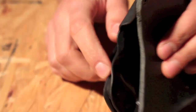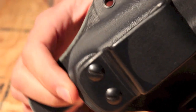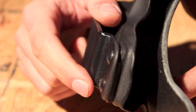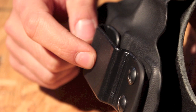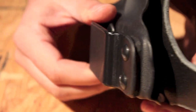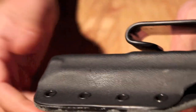Also, instead of using a gnarly little piece of Kydex as a spacer here — I can't tell what that is because I couldn't get these screws out as they seem to be Loctited in — those are going to be difficult to remove in the event that this breaks and you have to replace it under warranty. Use rubber for this application. Rubber is flexible and it transmits the flex of the clip into the rubber rather than forcing the clip to bend excessively, which is what's going to cause it to break over the long period of time that it gets used.